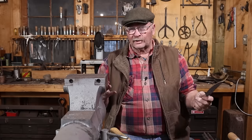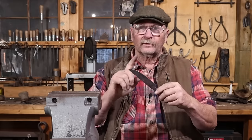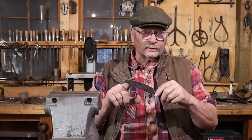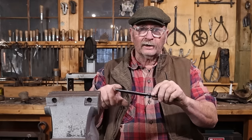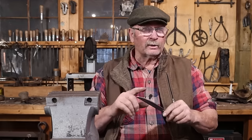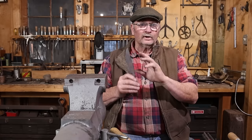You can use vise grips instead of tongs for something like this, but just be careful about vise gripping to the blade because you might leave a little divot that would create a stress riser. Speaking of stress risers, all of those file teeth that have been forged down can cause stress in this blade and it might be a place where it will break eventually. So I want to make sure that the cutting edge has no file teeth left on it and grind enough of the bevel in to guarantee there are no file teeth crossing over that edge.